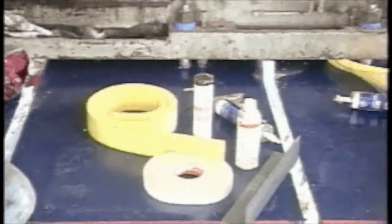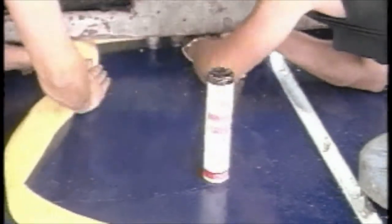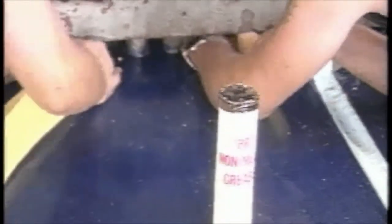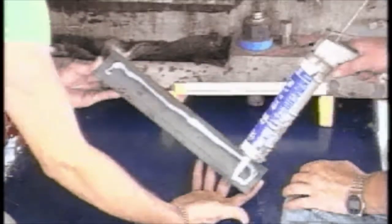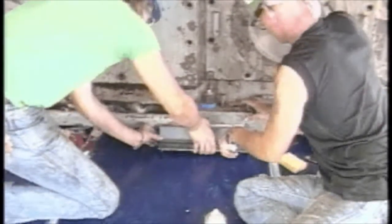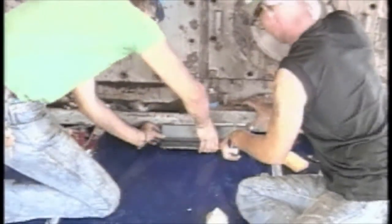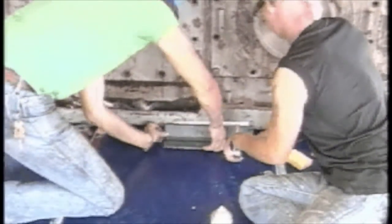After the Chockfast Blue has cured, the foam rubber forms are placed under the equipment, along with steel angle iron front dams, in preparation for pouring Chockfast Black chocks. The size of the chocks is determined by the equipment deadweight and anchor bolt tensions. All epoxy chocks are designed for a standard loading of 500 PSI.